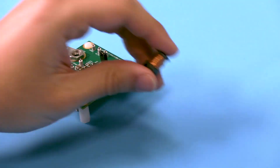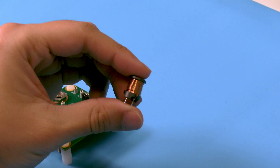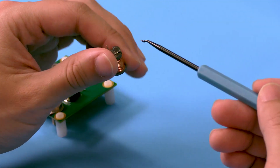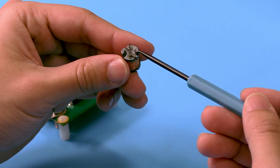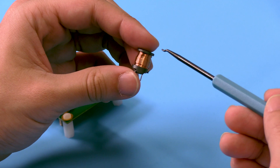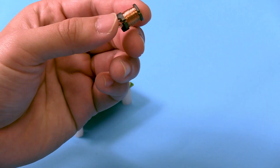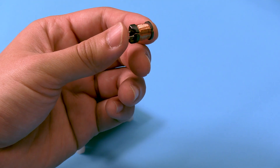This is where it helps to know how inductors are actually made. A standard assembled wire-wound inductor starts with a conductor wrapped around a ferrite core. Ferrite has a higher permeability than air, and since inductance is proportional to permeability, this increases the inductance value. This is then placed on a base, the conductor is welded to the terminals, and a ring is installed to cover the conductor. You can also place a cap on these for more shielding, but it's not the most effective approach, as we will show later.